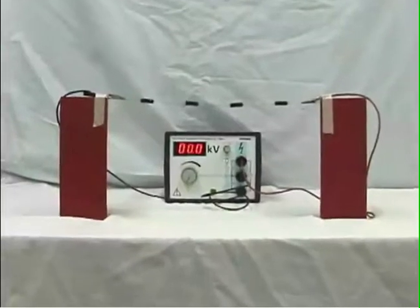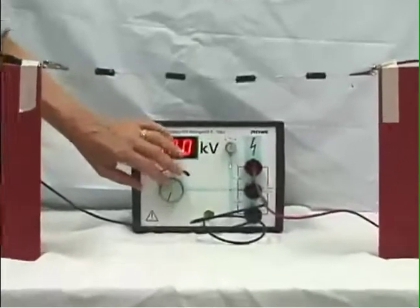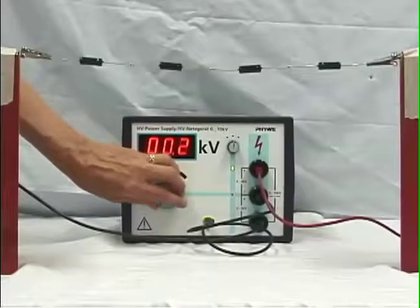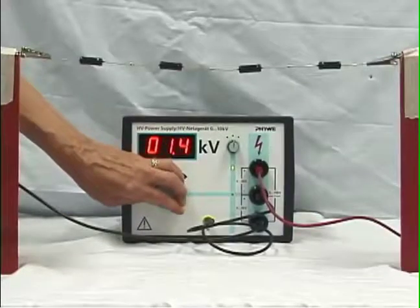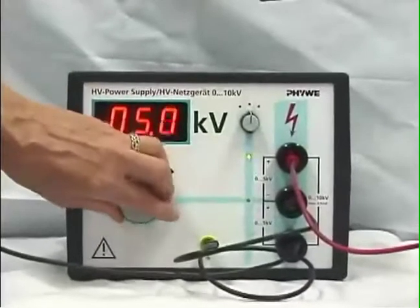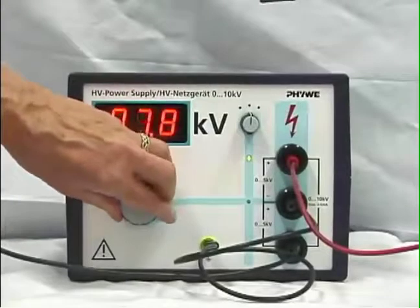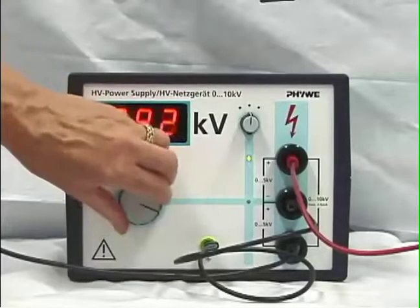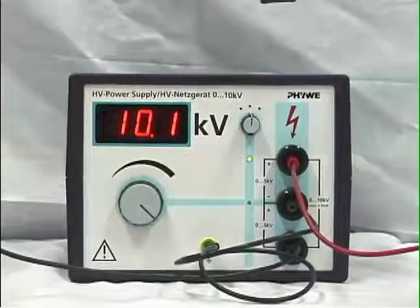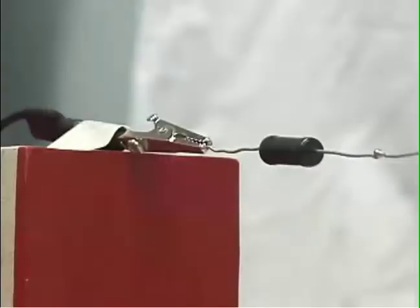In such a circuit, the amount of surface charge is enough to illustrate mechanical effects on a metal foil brought near the wire. We're going to raise the potential difference on this power supply to 10,000 volts, applying plus 5,000 volts to the right end of the resistor chain and minus 5,000 to the left end. The symmetrical arrangement means that the center of the resistor chain is at zero volts, and we expect the surface charge to be distributed positive on the right, zero in the middle, and negative on the left.